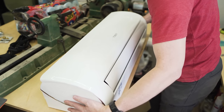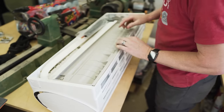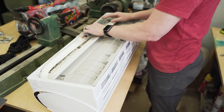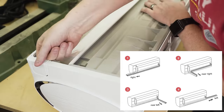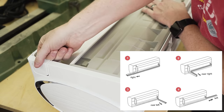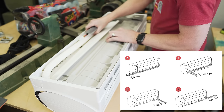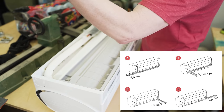We need to prepare the indoor unit. Flip it over — I've already removed the mounting plate, which is held by just one screw. We have to figure out where the exhaust and all the pipes are going to go. They could go straight out the back, out the side — you can knock out that side panel using wire cutters or strong scissors — or out the other side. In my case, everything needs to come out the lower left, straight through the wall.